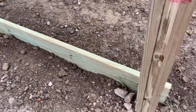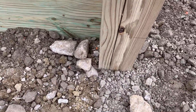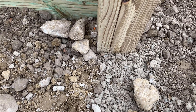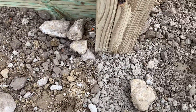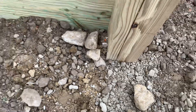When we dig down, we go down 54 inches. You can see we set this three-ply laminated column, and then we backfill with 411 stone. You see that sandy mix — I almost call it a highway berm mix. You obviously don't want to backfill with dirt; you want the water to aerate and not stick to the post.